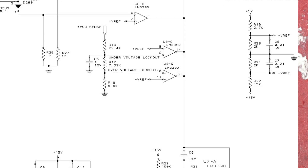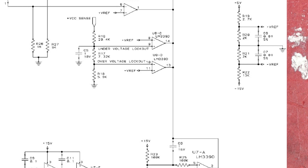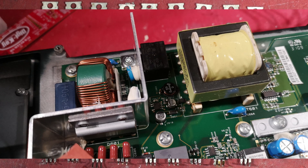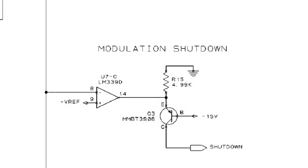I discovered that if the timing of the enable of the digital output drive is off when you first switch on — everything is discharged, all the capacitors, all the timing capacitors — you switch on, it does a clean switch on with a delayed start, everything settles down, the power supply rails are all there, and then the timer expires and the output transistors start switching.